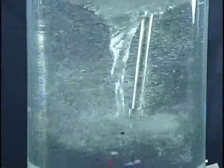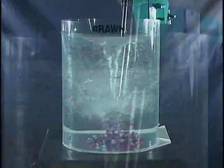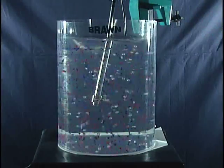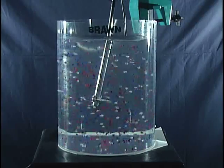We also have increased the bending force on the mixer shaft, which increases the chance of early failure. When we put the mixer back in the optimum position, right of center at the higher speed, we can see that not only do we get complete mixing, but there is no vortex.